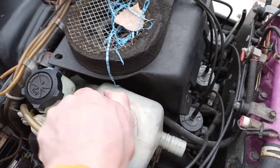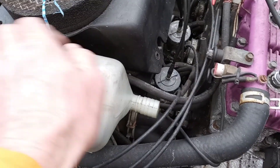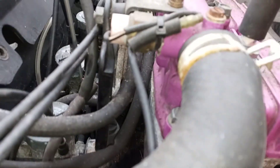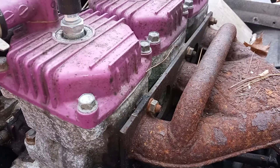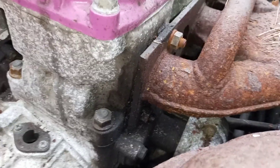It looks like there's coolant in it — pretty green in there so I think we're okay. I know it's got oil in it; when I was running it I drained the mystery oil and refilled it with fresh. The first time I ran it the original oil was in it, the second time I ran it on fresh oil and primed the oil system to make sure there was oil in the pump before starting. My understanding is that the 96 Ultra 680 had a water pump with its own separate lubrication oil tank, whereas this 97 is lubricated off engine oil, which I believe is the more preferable setup.